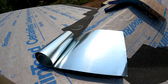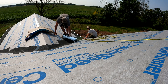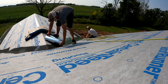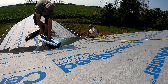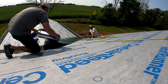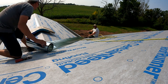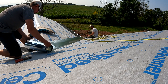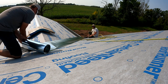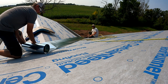So we're going to get this side rolled out and then we'll show you how it all ties together. This valley is 20 inches wide galvanized — you need a snip. It's probably 28 gauge. We're going to make sure at the bottom that we have plenty of extra, and then we're going to cut it and give it some room up at the top. We'll show you that in a minute. It's kind of a two-man job here and we'll show you a little bit more detail once we get it set.